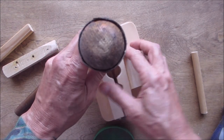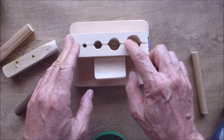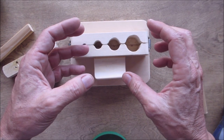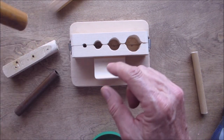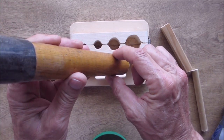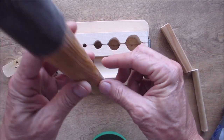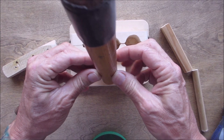So that was the reason for making the little kerfs, the little chamfers on the side there, as you could see them. So if you have something much bigger, if I didn't do that, the edges of the circle would kind of dig into it, and I didn't want that in case it was something delicate. So by easing those, it kind of makes like a little four jaw clamp around it.